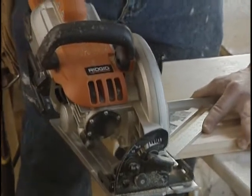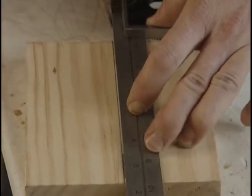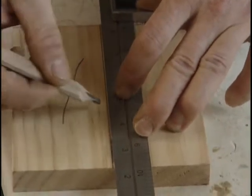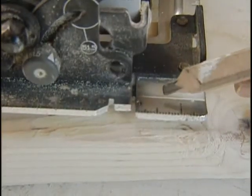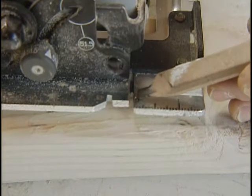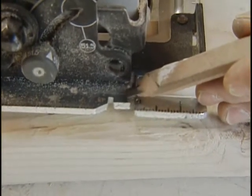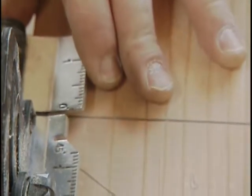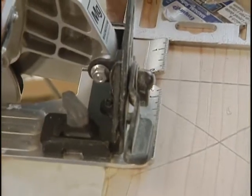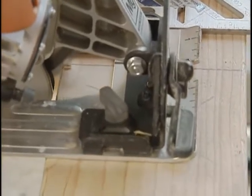Let's start with cross-cutting. You can avoid a lot of confusion if you draw a line laying out the cut and mark the waste side of the board with an X. Circular saws have two marks on the plate that show you where the saw will cut — one mark shows the left side of the cut, the other shows the right side. The space between is called the kerf. Use the marks to position the saw so that the kerf, which becomes sawdust, is on the waste side of the board. With practice, you can use the notch to cut along the line and get a clean, straight cut.